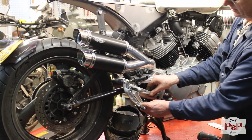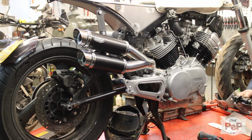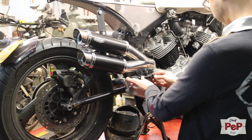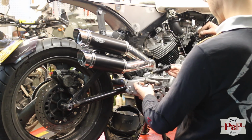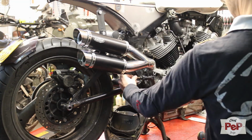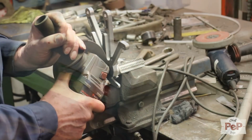The brake pump with fluid in it and the hose for the brake fluid can't be too close to the exhaust. Aprilia RSVs of a certain year, like 2003 or 04, are known for their failing rear brakes because the brake pump is too close to the exhaust. The fluid heats up too much and creates air in the pump, with a failing rear brake as a result. I wouldn't want that.